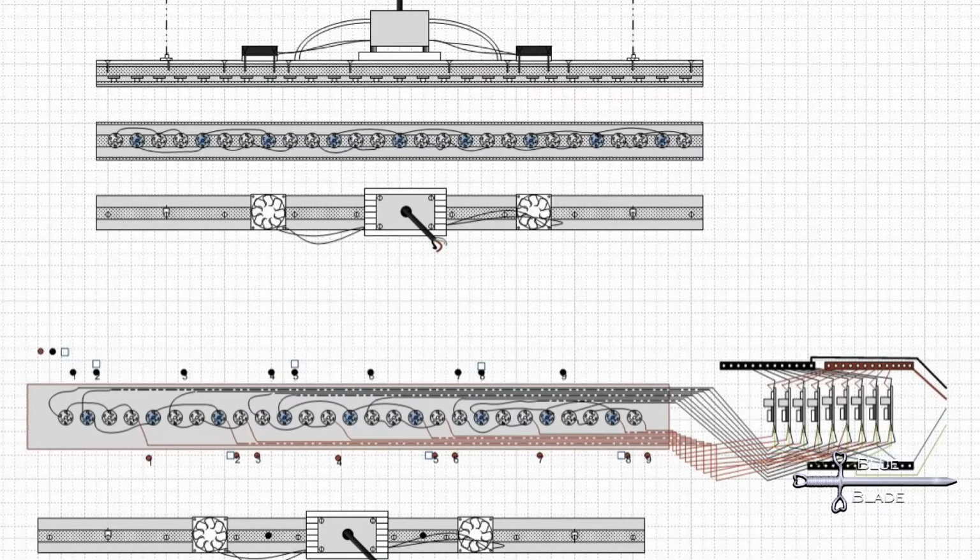These drivers, and the LED colors chosen, and the wiring changes needed for them are really the only difference between the one in my DIY video and this fixture. As you can see in the diagram, since each driver needs 12-volt DC, ground, and PWM, and each only drives 3 LEDs, and there's so many of them, there's a lot more wires.